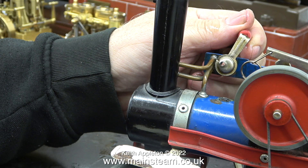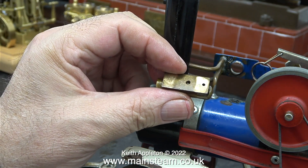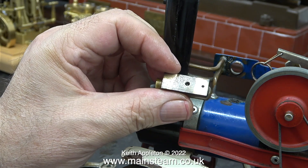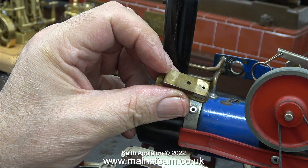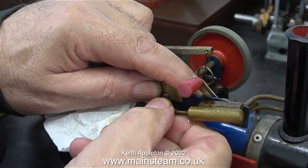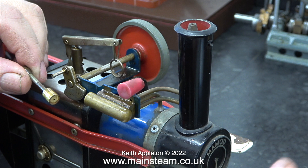I've removed the trunnion pin, which is the pin with the spring that holds the cylinder to this unit. As you move the massive reversing lever it changes the position of the cylinder relative to the ports on the port face. With the trunnion pin removed I can have a look at the cylinder, and if you look carefully at the cylinder the port face wear is quite uneven at one side. What has caused the problem? The answer: the owner of the engine. Here I'm demonstrating what I've just been talking about and as you can see, a lot of pressure is put on the right hand side of the port face when you pull the piston away from the crank pin. Here's a piston that I removed from the cylinder the wrong way - the problem had been caused a long time ago and not by me.